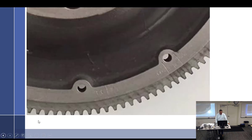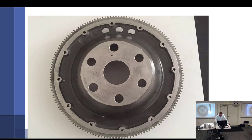So we can simply put this starter ring gear support. It has numbers right here. It says top center, and somewhere over here it says like 25 degrees, maybe 20 right there. So you pick that, and over here is where the starter goes, and there's a little tiny hole, maybe a number 40 hole, that seems to be drilled into the starter for no reason whatsoever. You could put a piece of welding rod in it, and it lines up with those numbers. Then on the back of this you would have 25 degrees, which lines up with the backbone of the engine. Once you've verified, in our case, it's 25, those numbers are legitimate. And verify, because how many ways could you put this on?